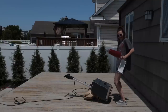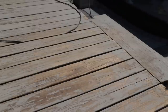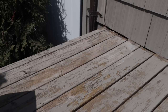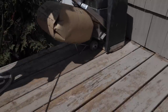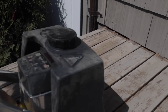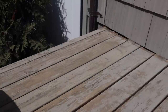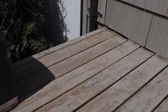I really wanted to strip this deck completely down to bare wood but it just wasn't going to happen — I don't know how long this paint has been on there, and it was sticking really well. This sander was honestly a true champ and was getting through a ton of the paint, but I was not able to get all of it up. The good news is I was able to sand it super smooth, so I came back the next day to start staining. I ended up going with a solid stain and it stuck really well and ended up looking so beautiful. Once I was done using the sander and power washer, I got them back in my truck, drove them over to Home Depot, and returned them.